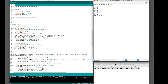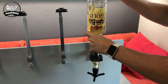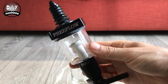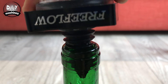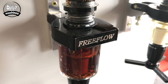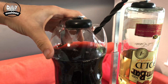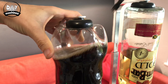After you have finished refining the values, write it down somewhere. The first drink I'm going to program is a rum and coke — a very simple one. I mount rum on the first optic and a bottle of coke in the second optic. For the bottle of coke I'm using a free flow optic. Unlike the measured ones, it allows you to continually pour a drink whilst you have the paddle pressed up against it. This is ideal for mixers, as it allows us to control how much fluid goes into each drink. We do however have a problem with carbonated drinks — as the carbonated gases escape from the liquid, they collect at the bottom of the bottle, forcing the liquid out. To overcome this, I drill a hole in the bottom of the bottle after it's mounted, and this allows the pressure to escape.